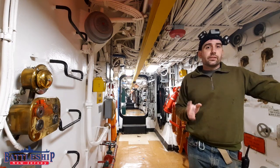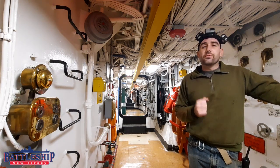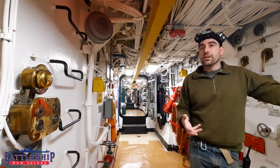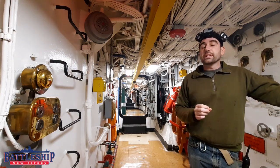But it's armor, it's very rigid, it's very brittle. So even though it'll stop the projectile, the force of the impact may cause spalling, which is splinters breaking off the back face of the armor, even though nothing penetrated it. So, to protect against that,